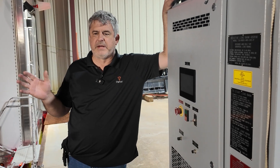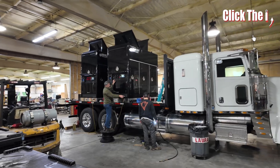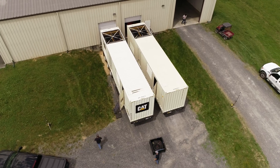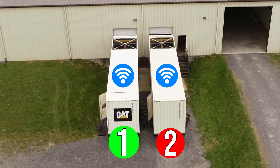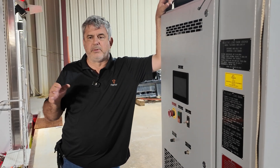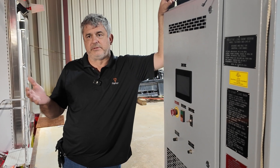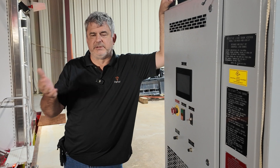These three 500kW generators are paralleled together. You've seen videos we've done — movie quad generators, two or three or four of them together. We've got a video on this channel of a couple of two-meg units, four million watts of generation, where we parallel them together. We've got whole videos that talk about paralleling and how that works. It's a neat concept because you don't get a blink, you don't get a brownout, and you don't have to have a bunch of sophisticated electronics like a UPS to get that redundancy in the field.